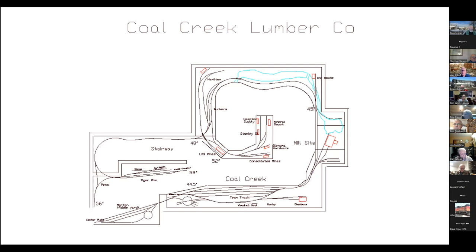There's an awful lot of really good video of timber being cut. The problem was the hell of a lot of waste from the big circular blades because of the kerf. And if you're cutting thousands of board feet, you're making a lot more sawdust than you need. So a bandsaw is better. The blade was thinner and quick for cutting large structures. One of the mills in the Converse Basin area had one of the largest bandsaws in the world. The circumference of the blade was 96 feet. Gives you an idea how big a sucker it was.